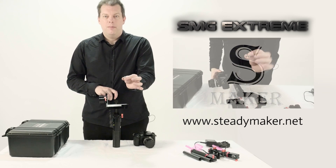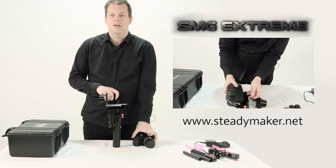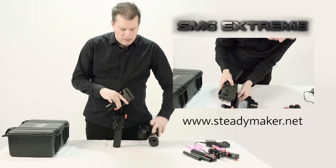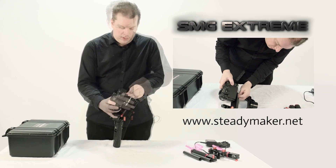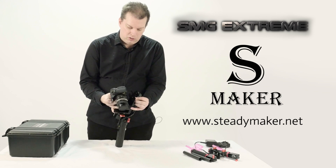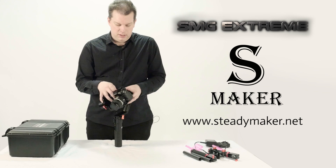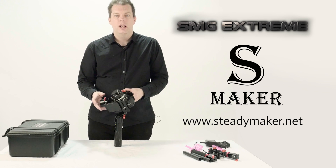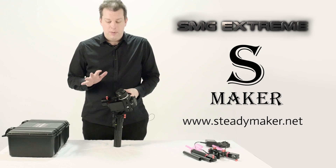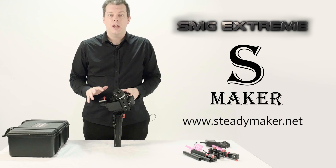Remember you have a plastic bag in your unboxing with a small screw — this is for the tripod mount at the bottom of your camera and will attach the camera to the cradle. Place your camera roughly in the cradle and then put the tripod mount screw into the bottom of the tripod mount and screw it onto your camera. Don't worry about the positioning right now — you're just looking to secure your camera in the cradle. Then we will isolate each one of the axes in turn and make sure it's balanced, and at the end check all three axes together.